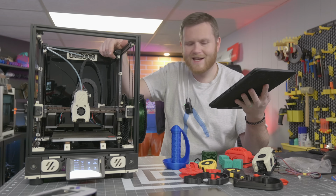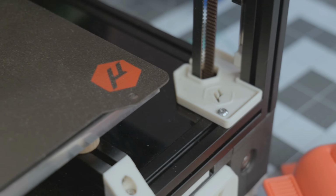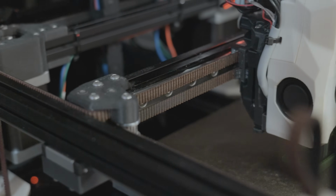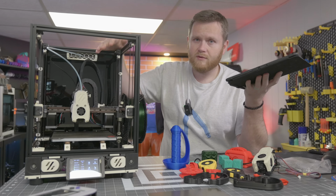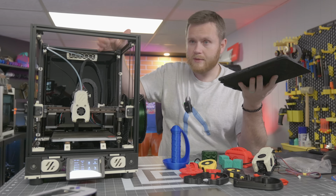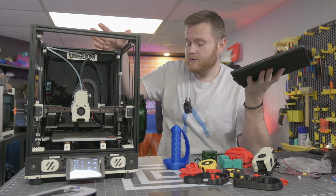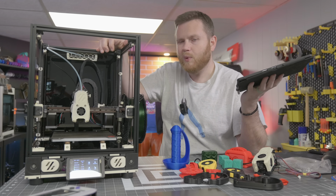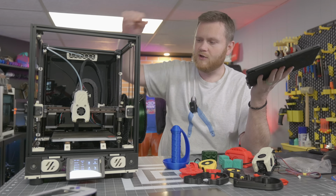So fun size. 4 is that this is a shrunken 2.4, like I mentioned several times now. The weight is really down low. It has a rigid mounted bed, which is awesome, and it has this slick flying gantry design. There's a lot out there about these machines. It's not a hidden secret. There's definitely companies out there like Sovol that are taking the flying gantry and the 2.4 in general and making their own machines out of it. They're open source. They're welcome to do that. And this is one of those. It's just a great design of a machine, very unique, and one of those trick builds where it's just amazing to see it function with the 4 separate Z motors and its Z-tilt functionality.